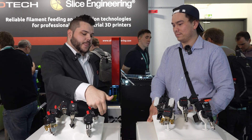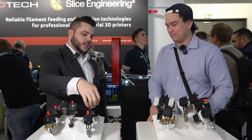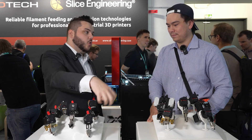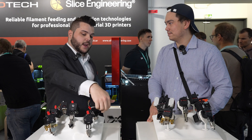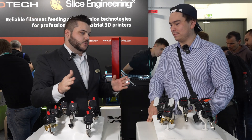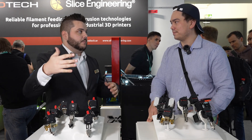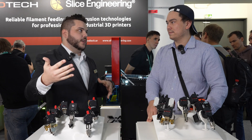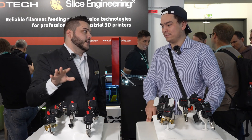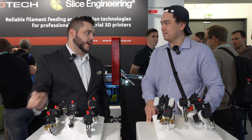It works the exact same way that the ACE setup does. This is our conduction heat break — it's conducting heat to this plate and you're cooling it there. You could route the heat all the way out of the printer in places where liquid cooling isn't effective. If you're in an insanely high temp enclosure going north of 150°C, conduction is going to be your best option because you don't have to worry about the chamber temperature to cool the hot end.